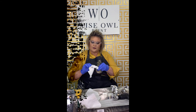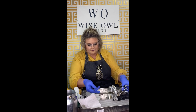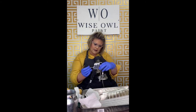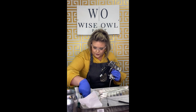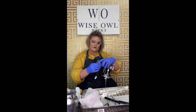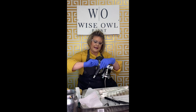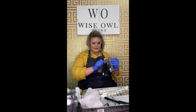Next, on the back part of your needle, a little bit of that lube on the fat part. You don't want to go to the tip with it, but right there. Okay. Carefully insert it in the back hole. It will pass through the handle, into the nut, and into the thing. Press with your finger. Then, it's time for the spring, if I can find it. And this also is another area where you'll want to put lube, on the fluid adjustment knob. You'll want to make sure you keep lubrication on that once in a while too. But I didn't clean it or put in chemicals, so we're good to go. Tighten it all the way.